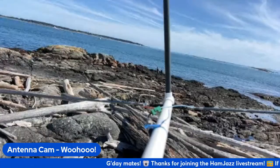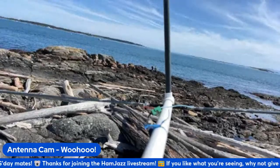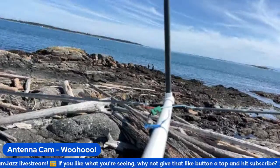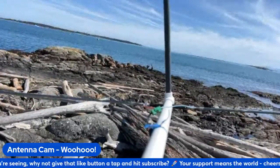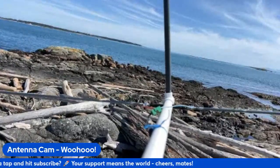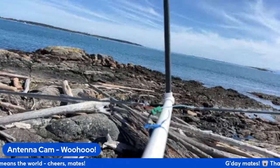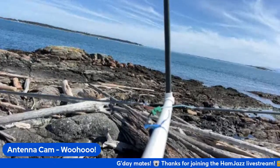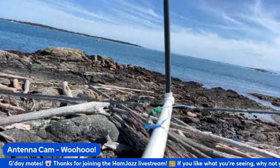Yeah, mate. So what we'll try to do, we'll try to find that. I usually do find that there is one band that really stands out. So 15 and 20 so far at this time of the day haven't been good. All right, we'll do a couple more calls on this, guys, and then we'll go right to the top. We'll go up to 10 meters and see if we can get some QSOs there. Oh, yeah, make sure I'm not running 1 watt.